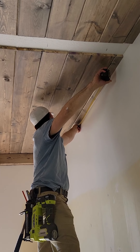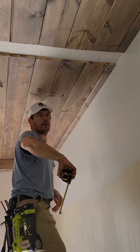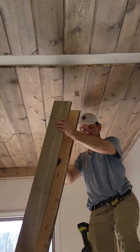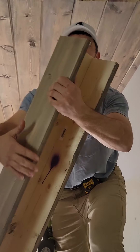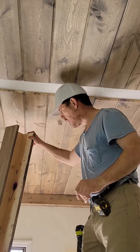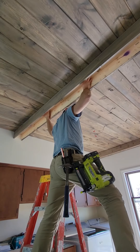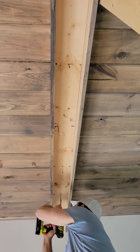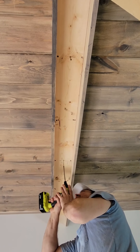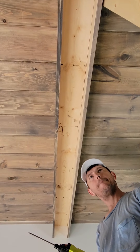I made a mark from one beam to another for what I needed, same on that side, so I nail it like a U — a box for the center beam. The screws go on each stud — I marked the studs. So he's screwing that in for good support. This beam is pretty heavy, just so it supports the rest of it, and this beam is actually holding all of this too.